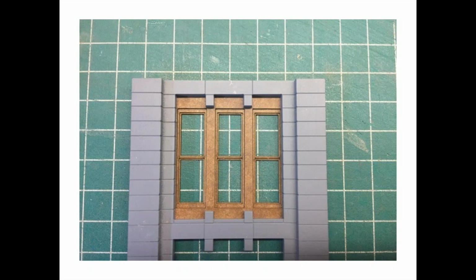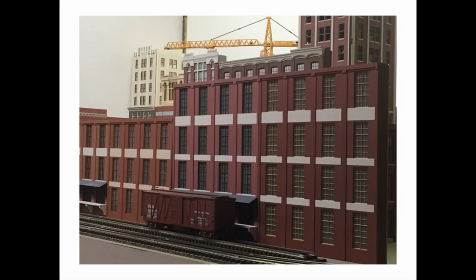This is a close-up of the window detail for the new downtown building. The windows are 3 layers of laser cut polyback and will be painted in 2 colors. There will be half-round columns between each window. Another feature that we're doing here in the laser cutting of the acrylic plastic that we make the elevations out of is, instead of straight cutting the opening for the windows, there's actually a minute notch. So when you see the scoring for the block, it actually wraps around the corner so that you see it on the inside cut edge. Next slide.